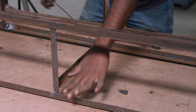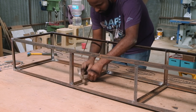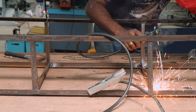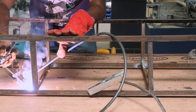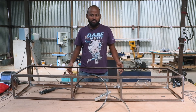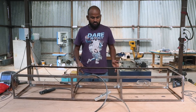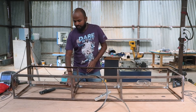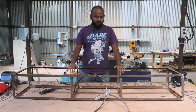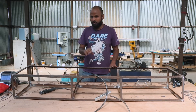The cuboid was a little bent, so I used cross bracings with the same angle iron. By hammering them into place, I was able to remove the bend, and these also serve as partitions for the shelves. This is the shelf that goes under the table, with metal frames giving it rigidity and also partitioning it. Next, I will cut plywood and put it inside to cover the sides and make each section separate. To attach the plywood to the metal frame, I need to drill holes first.